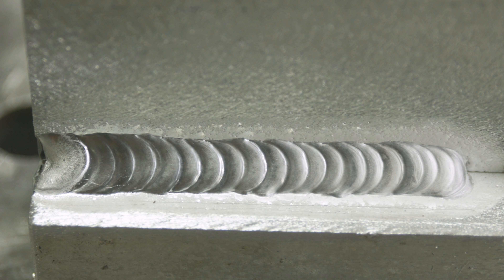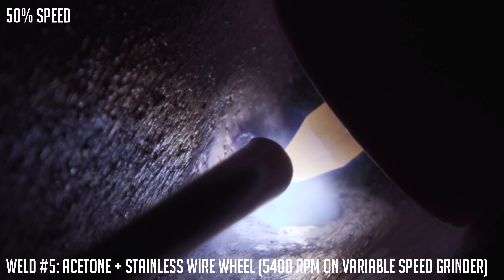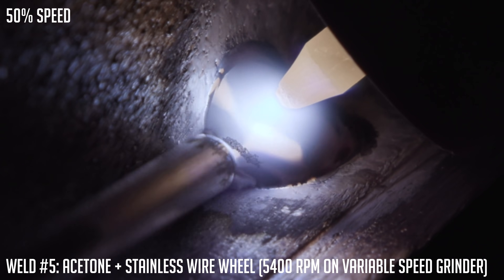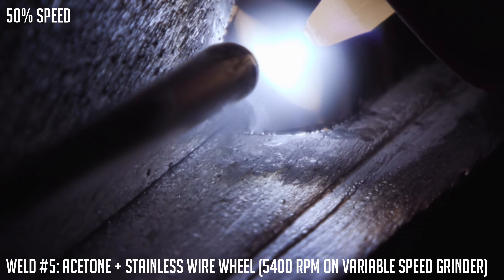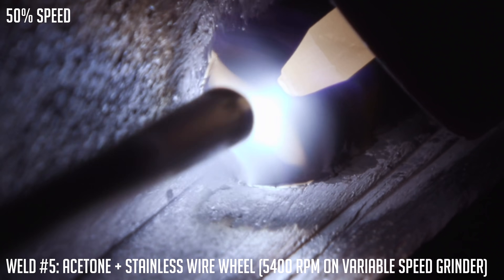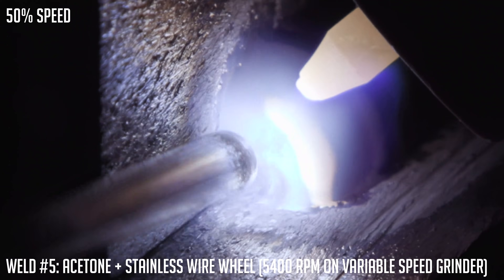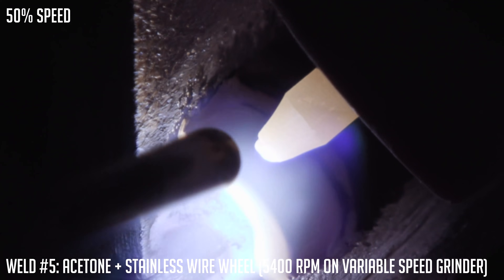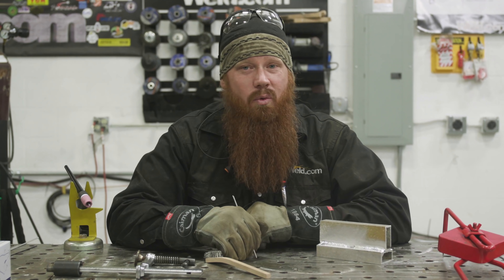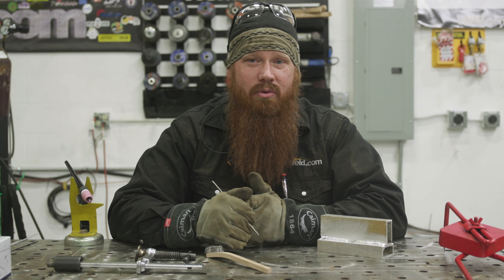The variable speed grinder with the wire wheel made life a lot easier and faster. If you have longer joints or longer weldments, that's what I'd recommend versus a handheld wire brush. However, if you're practicing or just starting out, the handheld wire brush is the best application — one direction only, get those oxides off, don't go back and forth. Couple that with a little acetone before you do all this, then maybe wipe it down again right before you get into welding, and you're going to be good.